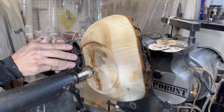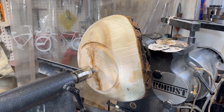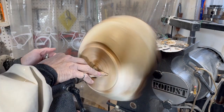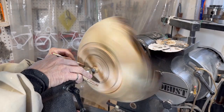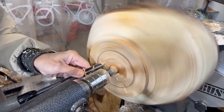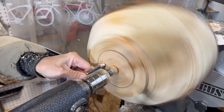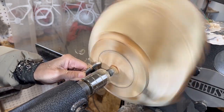The largest piece, which is around 14 inches in diameter, has a really large base on it. So I'm actually going to use a dovetail in the bottom of the base and try to retain that part of the base and get the full depth, because it's big enough that I can just blend it into the final shape.